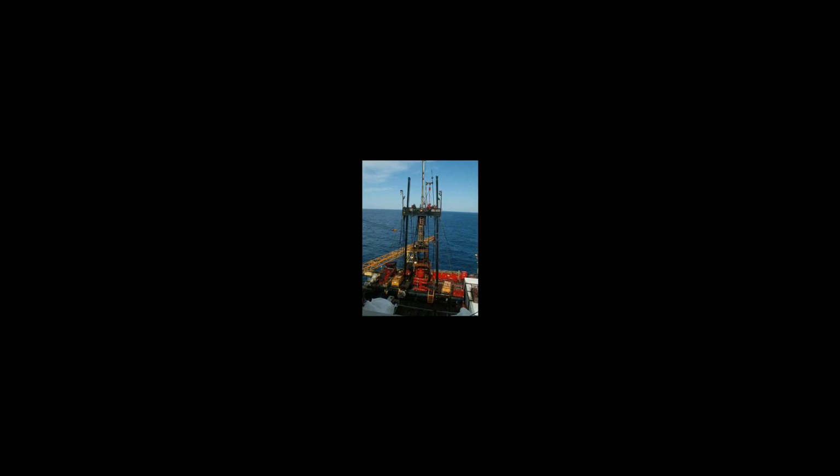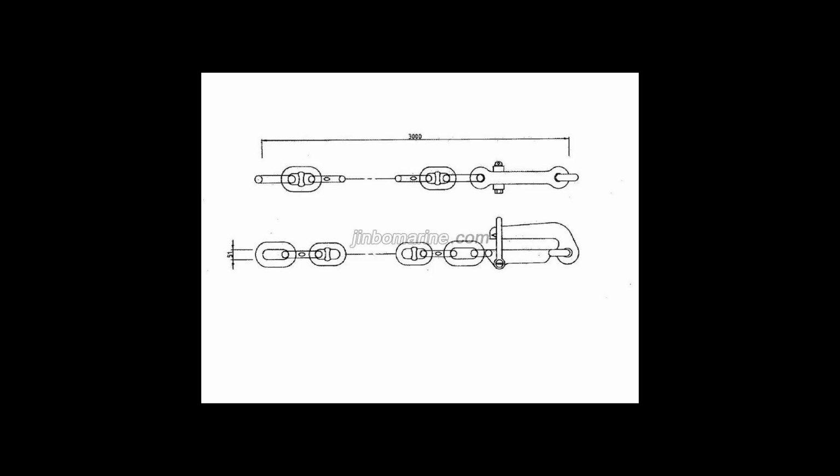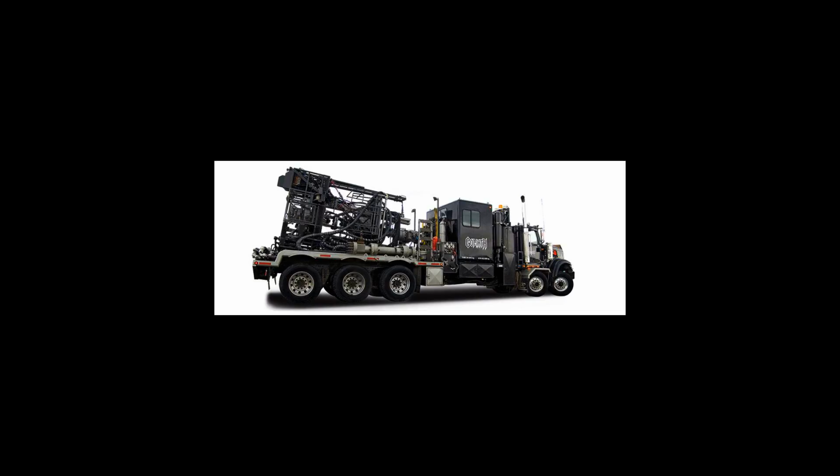Due to the large rigup, it is only used for the most demanding of operations when lighter intervention techniques do not offer the strength and durability. Unlike conventional drilling and completions operations, snubbing can be performed with the well still under pressure, not killed. When done so, it is called hydraulic workover. It can also be performed without having to remove the Christmas tree from the wellhead.